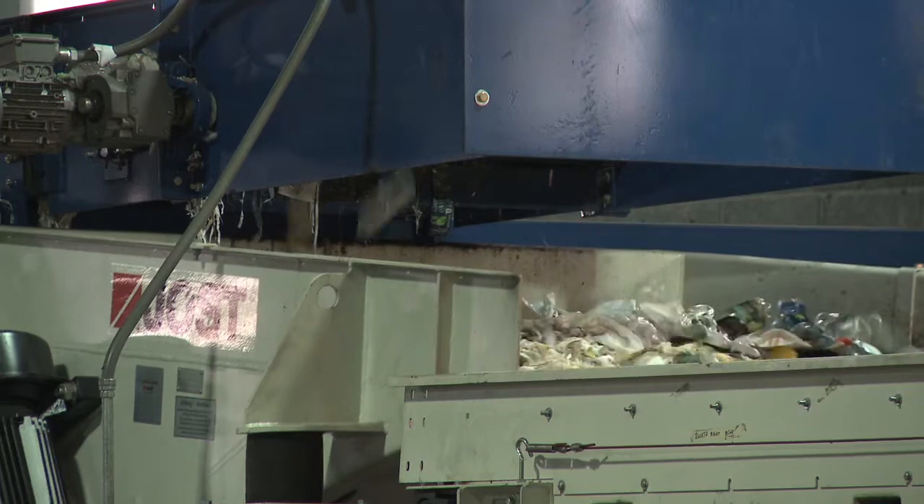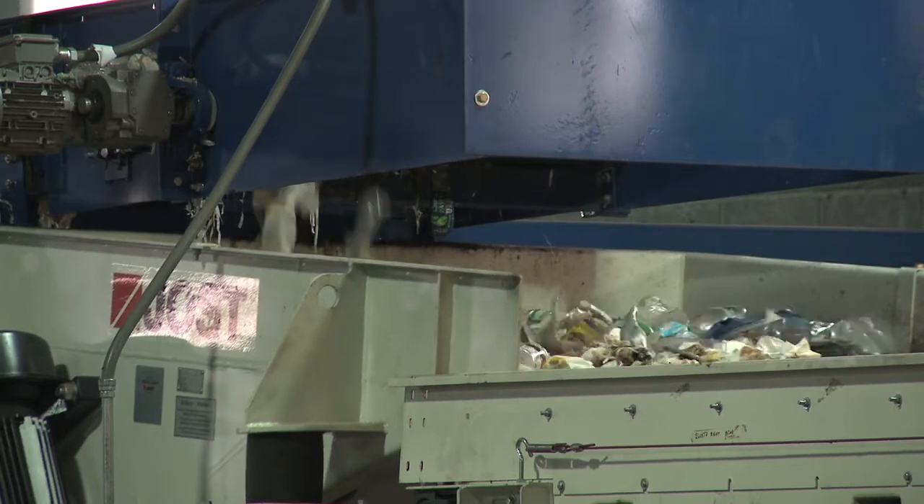It reads that information to 174 air jets and rejects the designated material chosen for that waste stream. At that point, all of your three-dimensional containers have been removed from the paper — meaning your tin, your aluminum, your PET plastic, or any other grades of plastic.